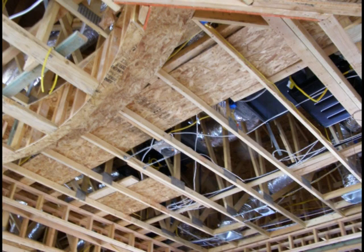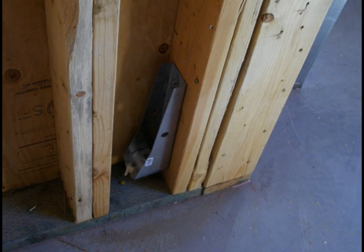You know just where to put the service outlet and where to terminate the home run. Be certain that all structural anchors or tie-downs are installed. Some anchors are as high as 3 feet, which is well above your wire runs. Again, this will keep you from rerouting wire.